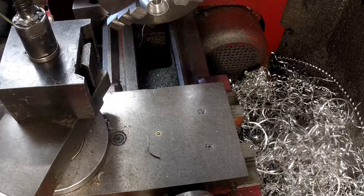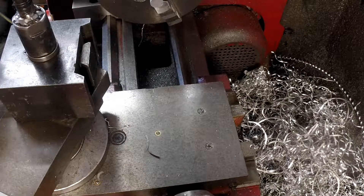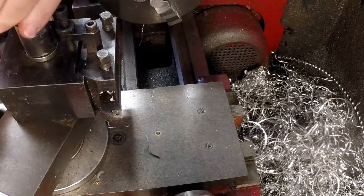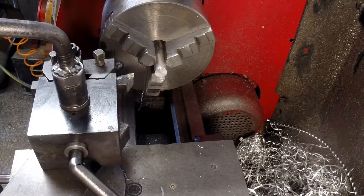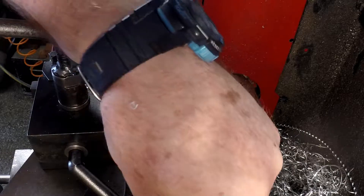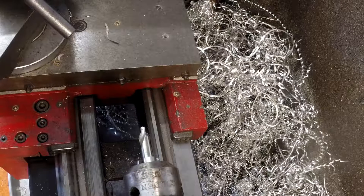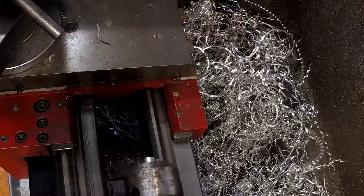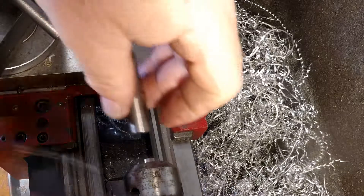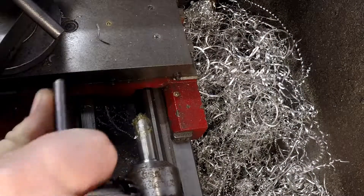For this part of the job, I'm going to use some 12mm aluminium rod. Face it off, and we'll just pop in a center drill. I'm going to use a dead center, because my live centers are so big that I can't get my cutting bit onto the work, especially on these smaller pieces.